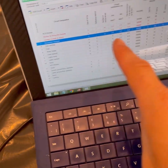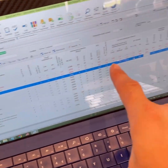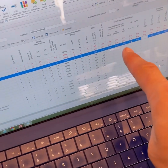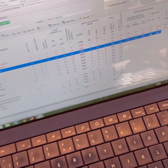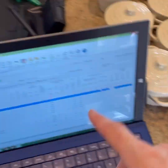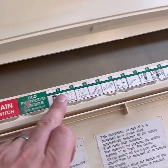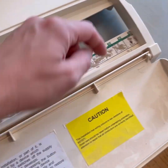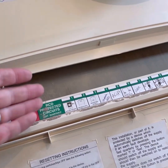So far on the first three circuits: the first had an open line, the second was all right, and the third has an open conductor - so not a great start on the ring finals. They've only ever had one minor works certificate for some alterations in the extension. Other than that there's no other certification, and as I showed you before it's such a poor arrangement on the main consumer unit.